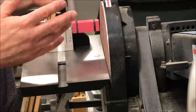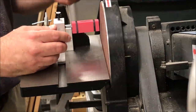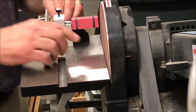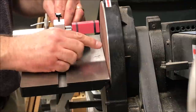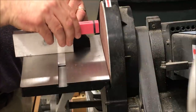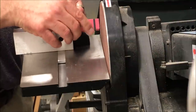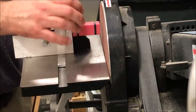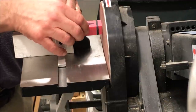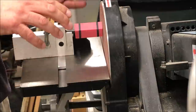It's going to get really noisy so I'll explain this before turning on the disc sander. As we move the miter gauge back and forth, never go past center — if you go past center it's going to throw all the dust and debris up in the air. You want to sand to about center and back off. As you're sanding, you'll notice I rotate the blank, which eliminates the possibility of striation marks, keeps the blank square, and gives a nice smooth surface that will mate against the pin components.